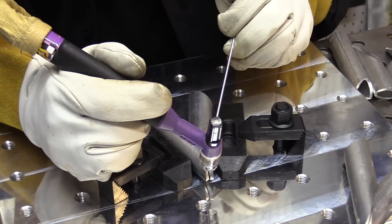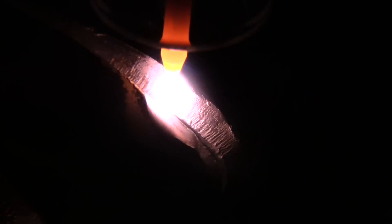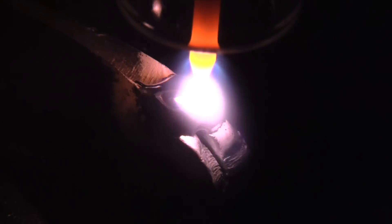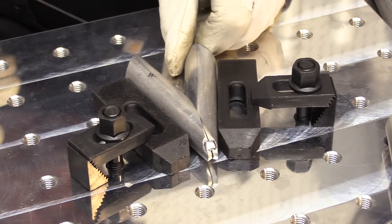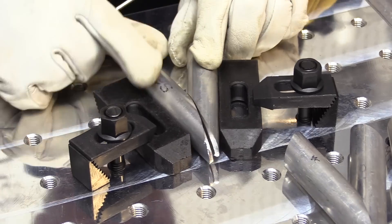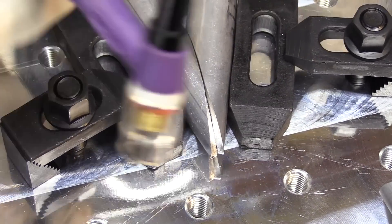I like to sneak up on tacks sometimes if I don't want to make them too big. If one side isn't puddling, I'll move the electrode over to that side and make sure both sides are puddling before I stick rod in there to join the two together. I put a little extra rod in there because aluminum is hot-short — the tacks are super weak if you don't add a little bit of extra rod, and you wind up getting cracked tacks.